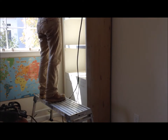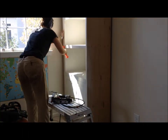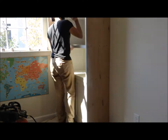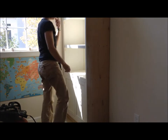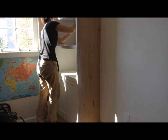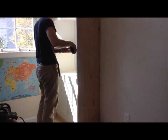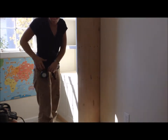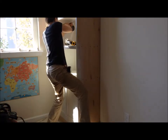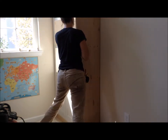Before putting the case up against the wall, I found where the studs are behind the case and marked down those measurements so I could transfer them to the inside of the case once it was in place. Since there's a little lip on the face frame, I marked the wall measurements on the front of the cabinet, then measured from behind the lip to get the new measurement — about 3¼ inches shorter. Once I had that, I transferred it to the back of the cabinet and countersank and attached it to the wall with 2½ inch screws.